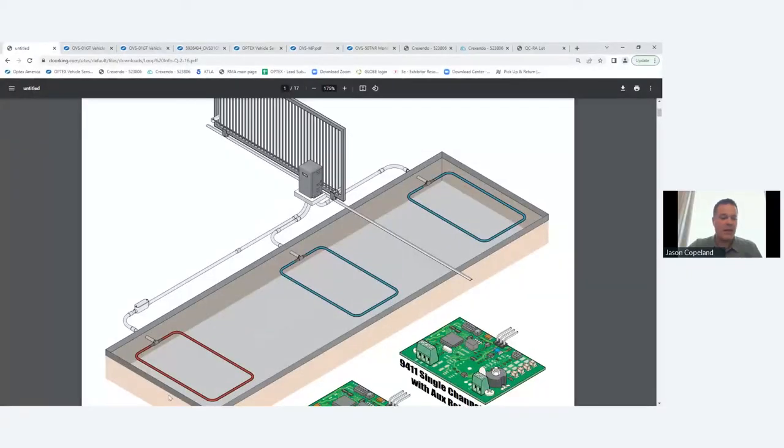Well, when I was showing you on the actual, let me share and it'll make it easier to understand. Okay. When you're doing ground loops, in that labor time when you're cutting the ground, no cars can drive over this. And when the silicone is drying, you basically have to shut this lane down, or in this situation the end user can't use this driveway until all that's cured and set. So that lane is basically unusable until that time frame. Usually, like I was saying before, 4 to 6 hours is kind of the minimum on that. So that lane is down until it's up and running. Makes sense. Thank you. Yeah.